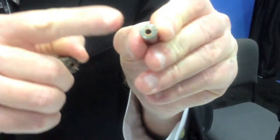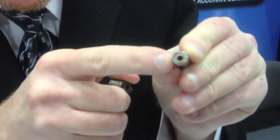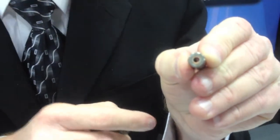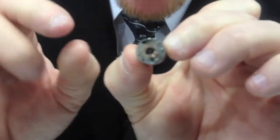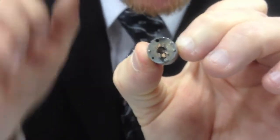Now finally, cooler. Let's take a look at the inside of a competitor's scanner. Every conventional galvanometer looks like this on the inside — it's got little teeny tiny wires on the inside, shoved up against the wall, in between the wall and the magnet. That heats the magnet and doesn't produce a lot of torque. So what we do is we bury the wire in little slots.